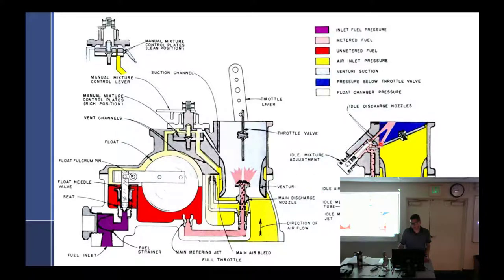We've got the discharge nozzles — there are two. If I screw this idle mixture screw in, it gets lean. Why? It's pinching off fuel. The idle mixture screw only affects the mixture at idle. Screw it in — lean. Pinching off fuel. Not air — just fuel. After this point where the pink and blue meet, that is fuel-air mixture. Right here where it turned pink — just fuel, just metered fuel.